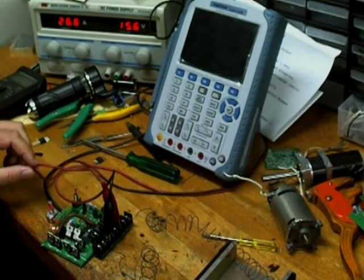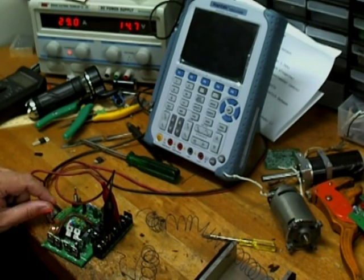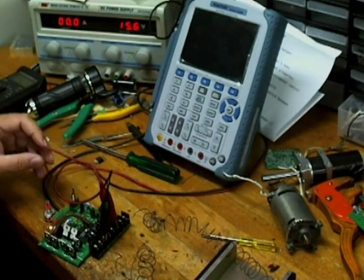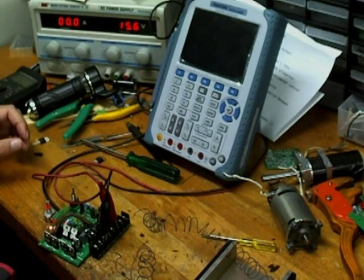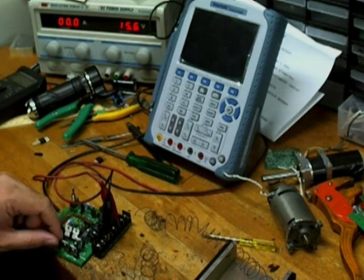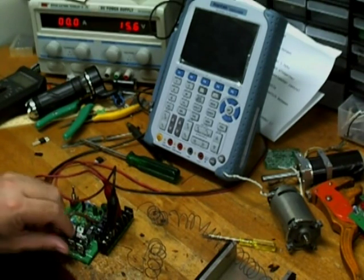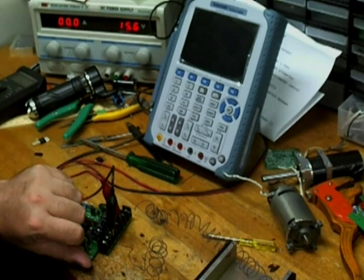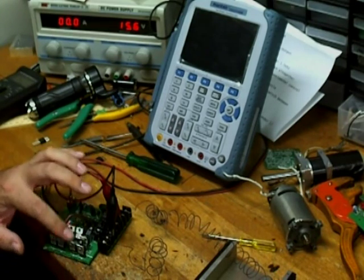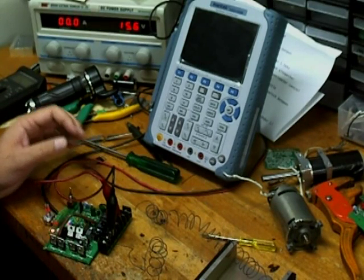The wires from the power supply are having a little bit of trouble. Just turn it right down and let those wires cool down a little bit. But yeah — you could run this; these aren't even the MOSFETs we'll end up using. Look at that — I can still put my fingers on it quite comfortably, not even hot. Just slightly warm, and that's 30 amps. You'd probably be able to run this at about 50 amps without heat sinks with the production version — that's 50 amps without any heat sinks whatsoever.